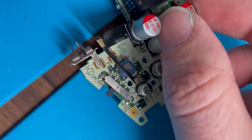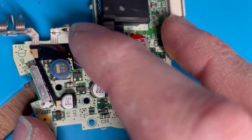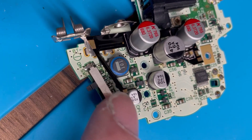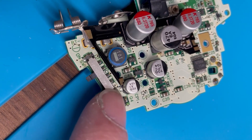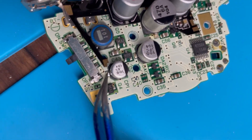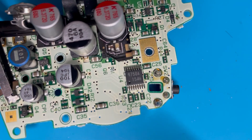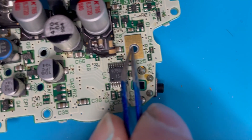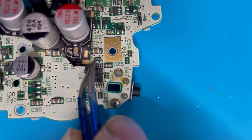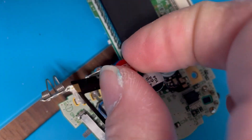The first thing we do is take the de-hum kit and place it into position. The first pad goes down here to the battery spring — this part will go to the bottom of this capacitor. At the top you've got two more pads that go onto these two capacitors here — to the bottom of this capacitor and the bottom of this tiny capacitor.